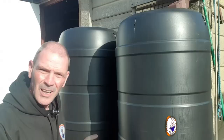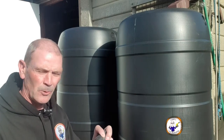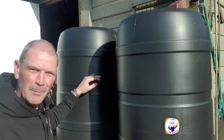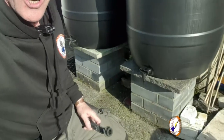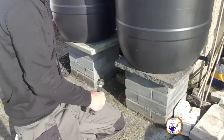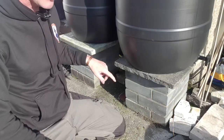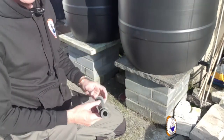Because I've got two butts, I want them both to fill up, so I'm going to put in one of these little link pipes. It goes between the two tanks - when one fills up to a certain point it starts filling the other. Before drilling the holes to fit it, I need to know where I want the taps. I was going to have them both at the front, but I've been told one's got to be on that side and the other on that side, because someone coming past with a wheelbarrow could knock the tap off.